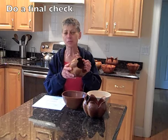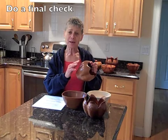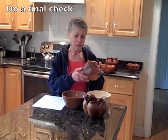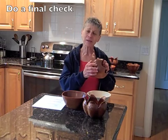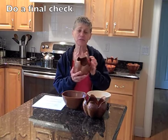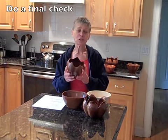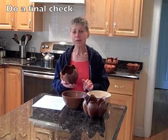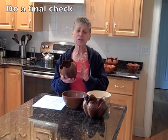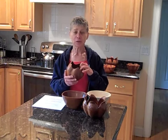And before the mineral spirits are fully dried, use a white pencil to mark the spots. And that will find little random spots of glue that you may have deposited inadvertently, or glue between the rings. Sometimes it's very hard to see and will show up only after you finished it. So you do a final check, and if you find you're rushing to finish it, put the project away, come back the next day, fresh, look at it again, and when you're satisfied that it's as clean as you can make it, then you go ahead and put on your finish.